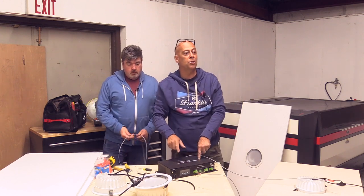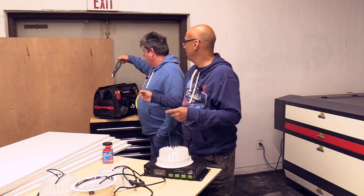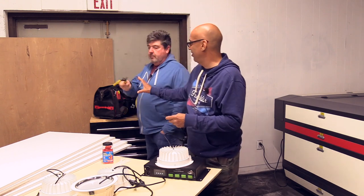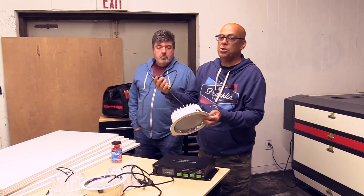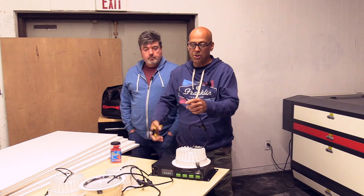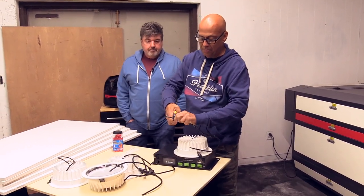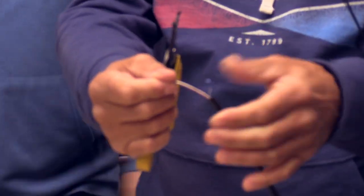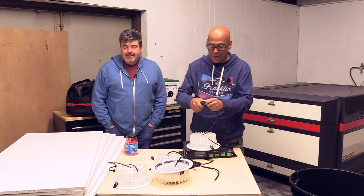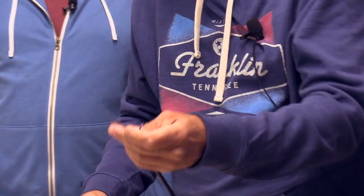Come back, install it. Just hand me the yellow strippers out of the bag in the middle there. Yellow strippers. All right. So, we're going to start with a warm white. Warm white, very simple. It's a two-wire install. You want to strip back the black insulation. You've got two leads, a brown and a blue. Brown is the common. That's all I strip them back, about a quarter inch.